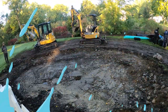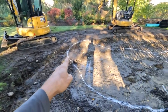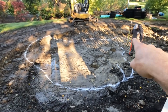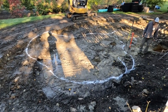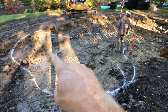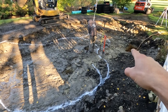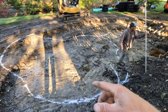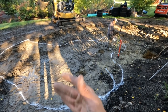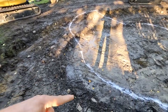We've got a 16 by 16 foot pond running from that point all the way over to that front line. We're going to dig this down to two feet, then dig a series of drain tile lines for subterranean drains. We'll run one main line across to our sump pit — a piece of ADS pipe going down into the ground — with a bunch of auxiliary lines running across. That collects groundwater and gets it to the sump pit so it's not putting excess pressure underneath the liner and bubbling it up.